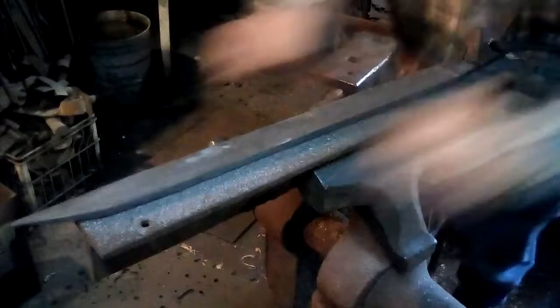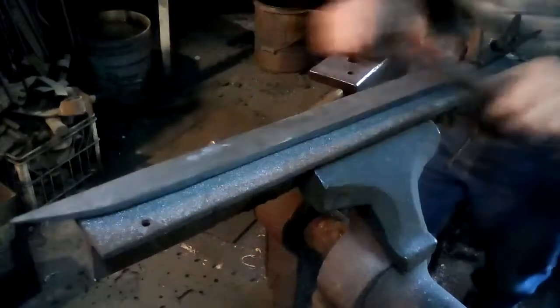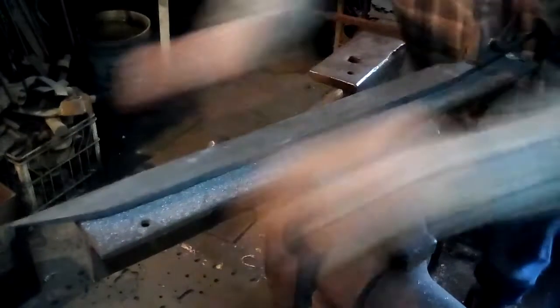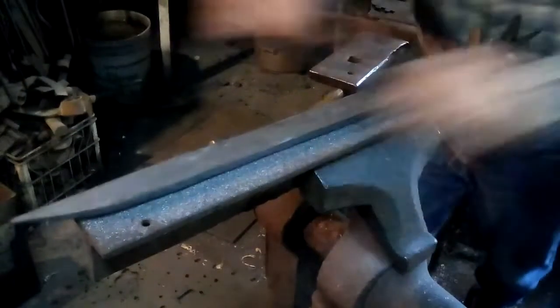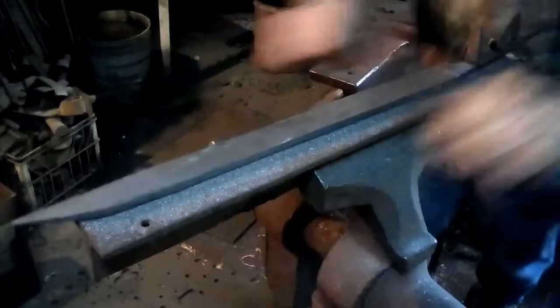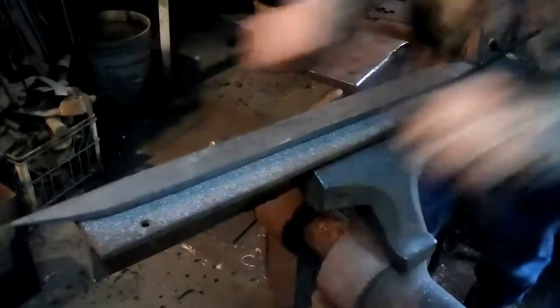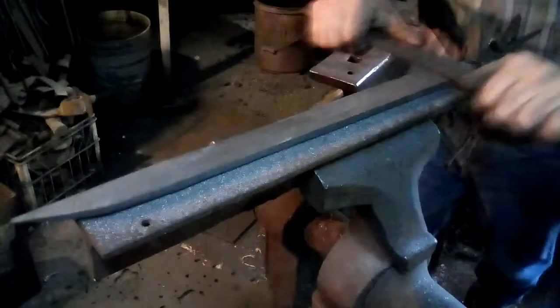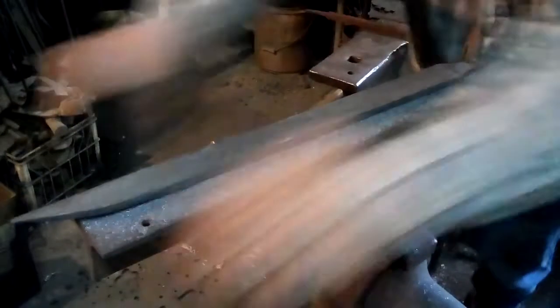And you also have to go head to tail, so to speak, because if you only work in one direction, your arms have a preference. You don't have a perfect range of motion. So you then do tend to put in arcs and curvature, and the only way you can prevent this from building up over time is to change the direction that you file from every now and then.